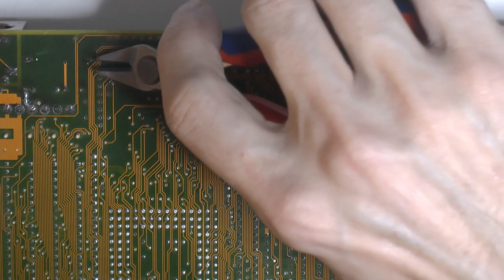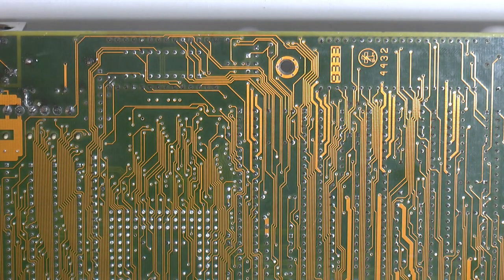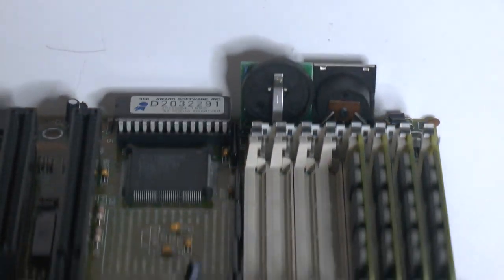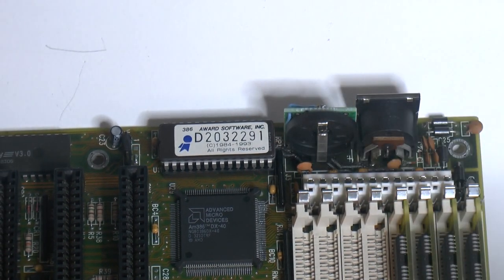Slip this so they don't short against the case. I don't think they would, but why risk it? Now I'm gonna test it without a battery first, so make sure I don't have any voltage in. So I did check now, and there's no voltage coming in on the plus pin here when it's powered on,